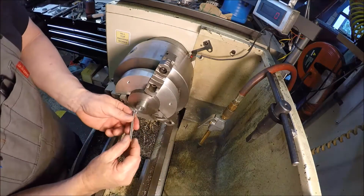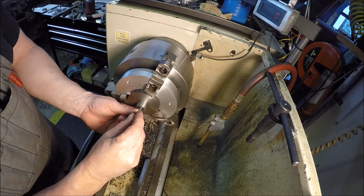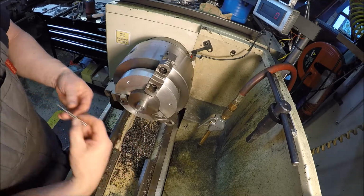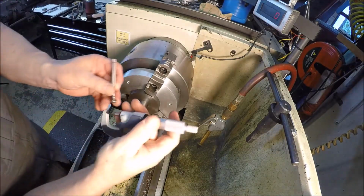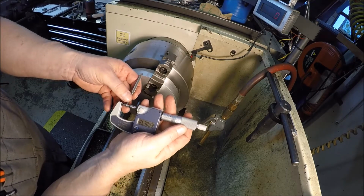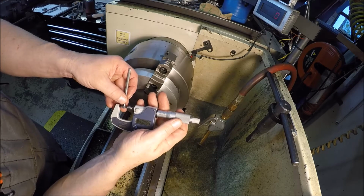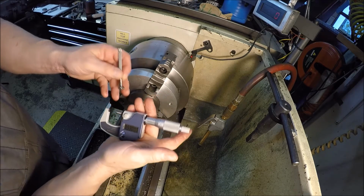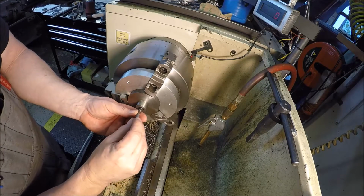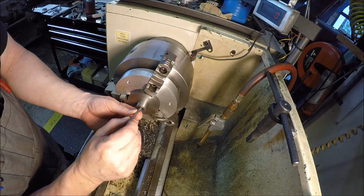And then if we do the old telescoping gauges, do the insert, snug, and then tilt method. We're getting 530. So this is reading large. There's 529 and 530. Check it again. So far the telescoping gauge and the inside mic both are reading larger than what the gauge pins read, or showed us, should I say.